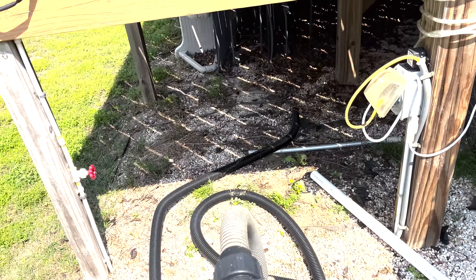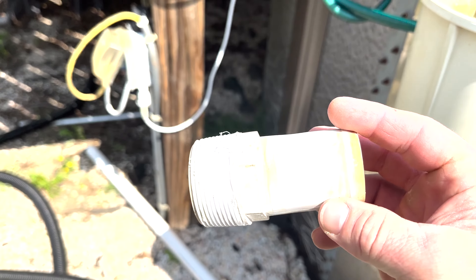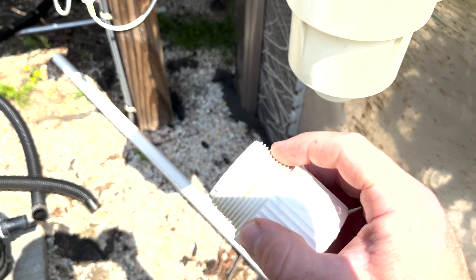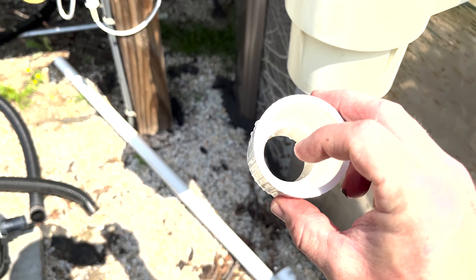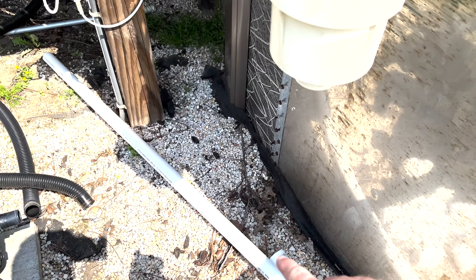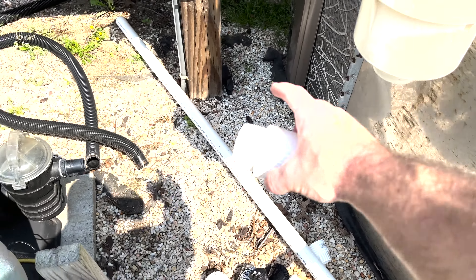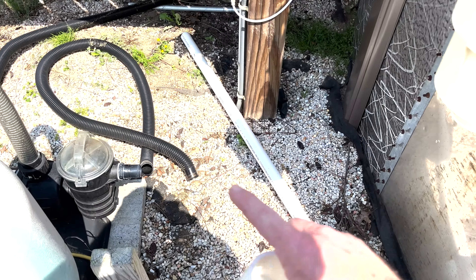So I am upgrading everything to hard plumbed PVC. To do that, you have to transition - you have to take one of these barb-style fittings off and replace it with a screw-in fitting that converts to PVC. I went to Lowe's for mine. In my case it's inch and a quarter, converting into inch and a half for the tubing. I've got a ten-foot piece of tubing here I can cut up, and we'll screw these fittings in and then hard pipe in between.